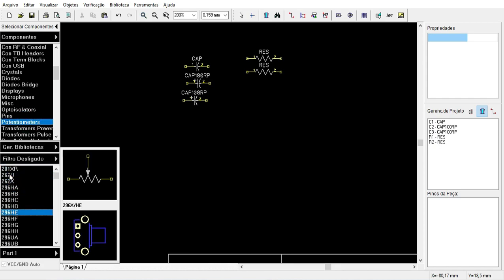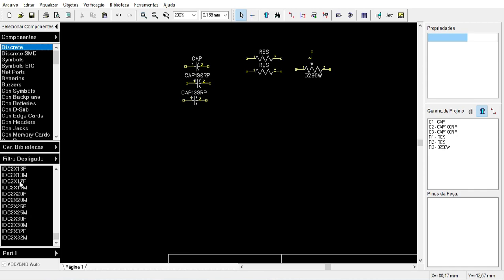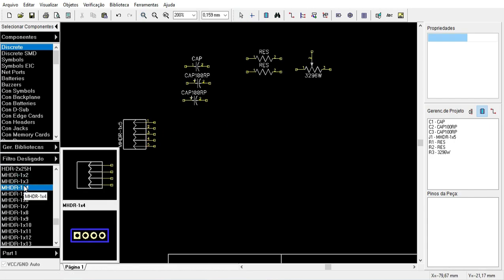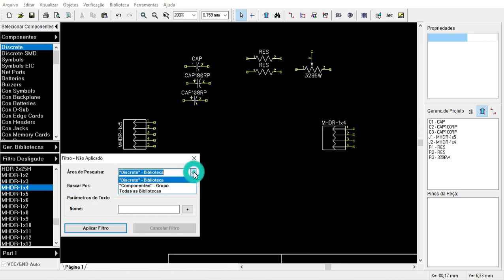You will have to adjust it for every TV. The intention is to get a video mode more simple, but to have better functioning on TVs. Today there are a lot of people from the 90s and 80s, where a modification was already made to have an audio and video input. And then it needs to be a more amplified signal. I developed a very simple circuit — basically a transistor where we will amplify the entrance signal. The signal comes from the base, and the reference at the collector, which is higher than the base, amplifies this signal. And then at the emitter, we have a stronger video signal.